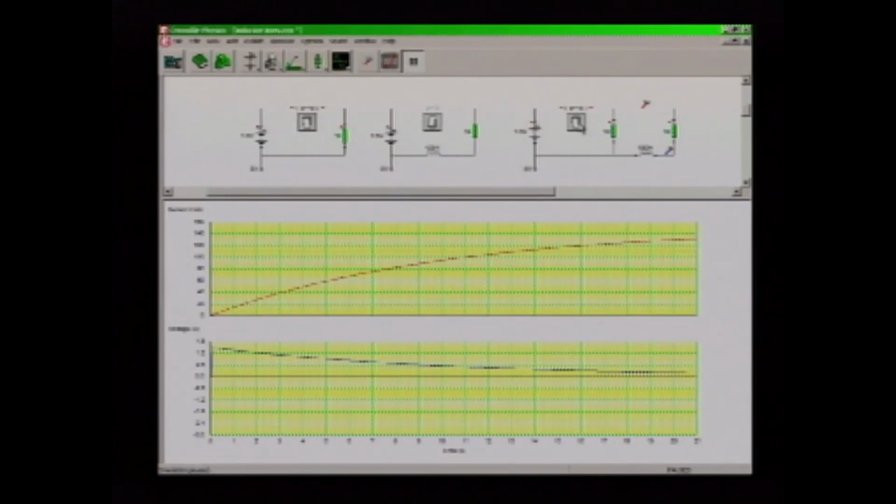What happens now when I open the circuit is that this current, you see that we have a current flowing through this inductor like this. That current will still flow, but since it can't flow through the switch, since it can't flow in this sense, it will go through this resistor, and you'll see the current in this resistor change signs. There are some really tiny little arrows here. And if you can see those arrows, you'll see them reverse as soon as I open the switch. Okay, so now the current is flowing up through this resistor. So now we have a current flowing like this.